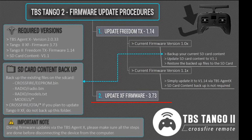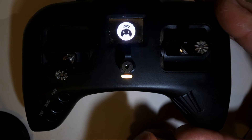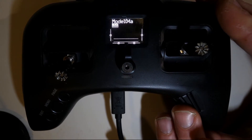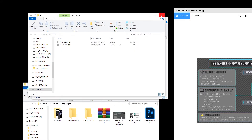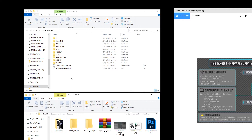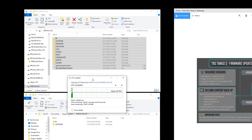On the left-hand side of the flowchart are the details of which files we actually need to restore back to the SD card — that's pretty important. So we turn the controller on, plug in the USB cable, choose USB storage, and on our computer that should pop up as a drive. There's the internal one for the firmware — we ignore that one. This is the one we want, and just to do things the right way I'm going to take a backup of all of it by copying it into a folder I've created called 'old SD'. It's about 140 megabytes.